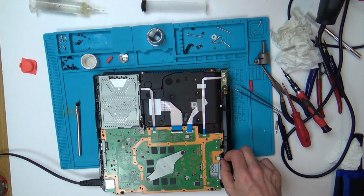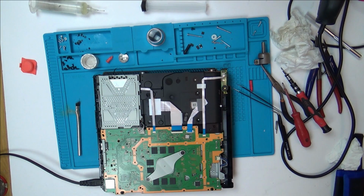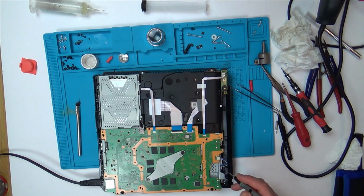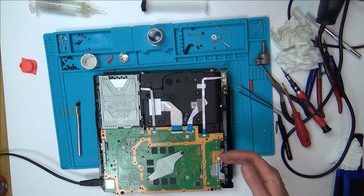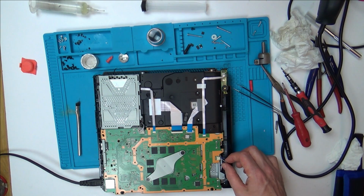So it must be this white wire here that actually tells the fan when to work and when not to work. So I suppose what I could try to do is trace the white wire back, because we've got 12 volts. I've been doing all my tracing from here, but we have got 12 volts there. Can't be ground, it must be this white wire. So maybe I should be trying to trace this white wire to see where that ends up, and that might give me an idea, because obviously the fan's cutting off straight away even though there's 12 volts here. So whatever it is that's telling the fan to work is not doing that, is it?